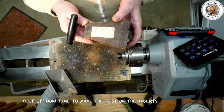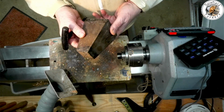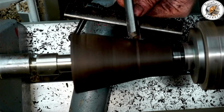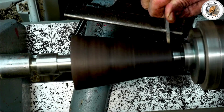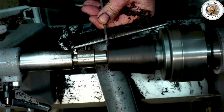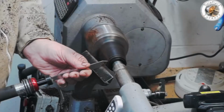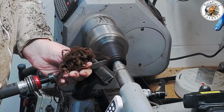So I've got some offcuts of African blackwood, which I think are technically clarinet bells. I've been lurking for about 20 or 30 years. I put a tenon on both ends because I decided I wanted to turn some small discs first. So with it rechucked, I then turned some little tenons on each disc so that I could rechuck them and then decorate them, and then parted off a series of them using the parting tool.